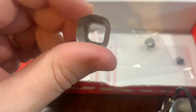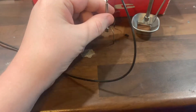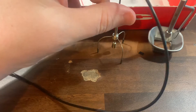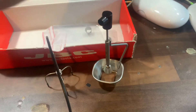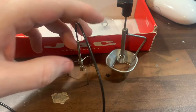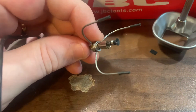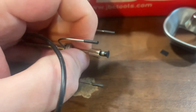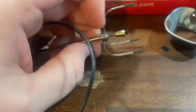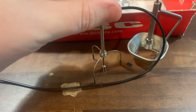Here you have the heat shields. These are placed over the ICs — as you can see, you can get them in tiny sizes. These tripods basically work by being spring-loaded; they have a spring inside, and when you push them down, they pop back up. The bigger one does the same. At the bottom you have a suction cup — this suction cup will attach to the IC. The heat shield will be placed over the suction cup by gravity, protecting the suction cup from heat damage. The bigger one has a bigger suction cup.